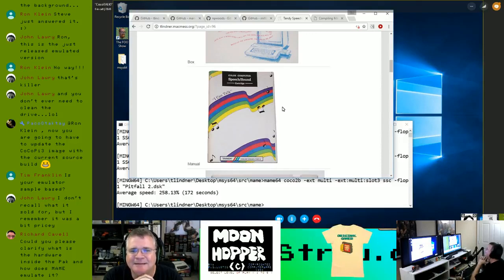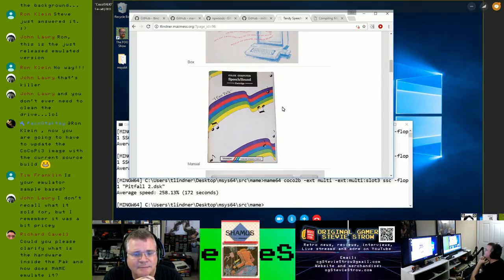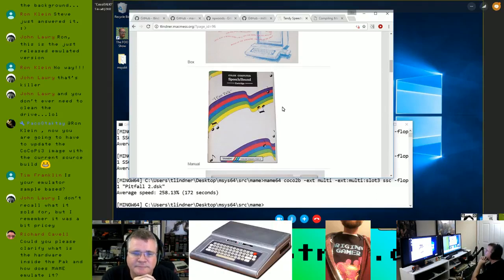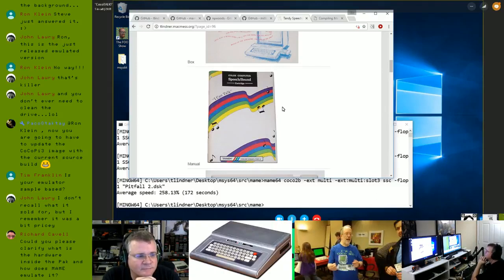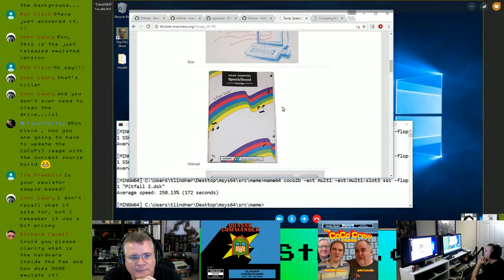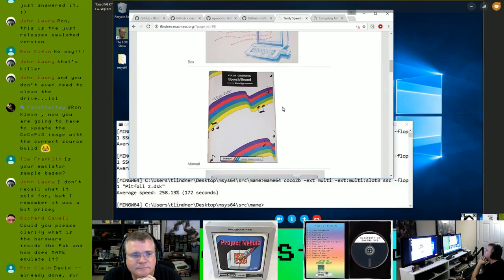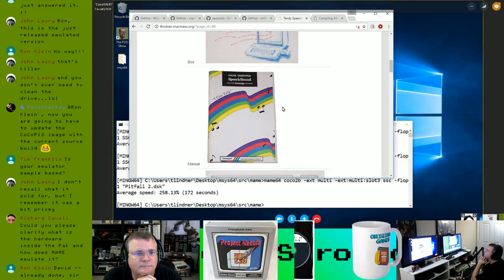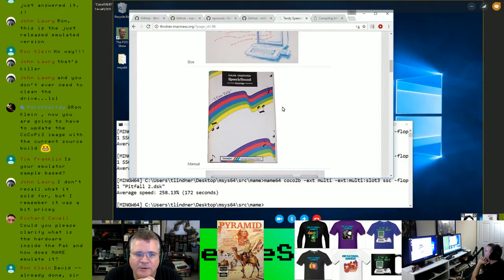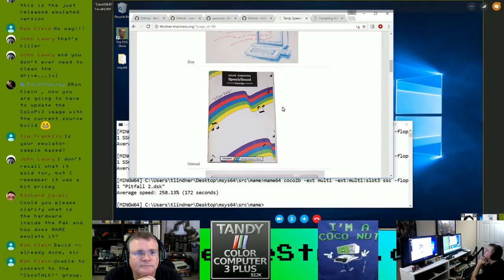And what was that? Well, it's called Trojaning. There's a pin on the microcontroller where it can act like a more generic CPU, where you can hook ROM up to it. But when you do that, the internal ROM disappears and is invisible. So you made a little step, but you got a big problem. So the solution was then to hook up a ROM to the device. We had to take the microcontroller out of the speech sound pack and hook it up to our own little board. So an actual card was sacrificed for the greater good. Yes, it was. And the pin was pulled to turn it into a more generic microcontroller.